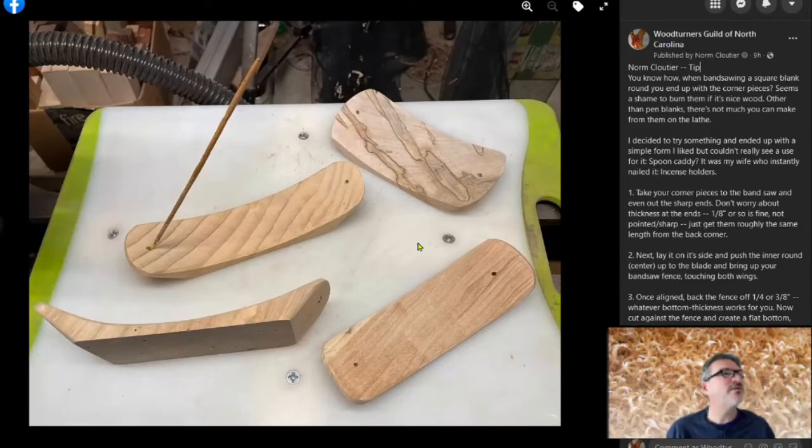The trickiest thing is to figure out the drill points. I said you can use the drill press. I ended up using a hand drill, just because for each one, given the width, you might want to change the angle that you're putting that at, because you don't want the burning segment hanging out over the piece.